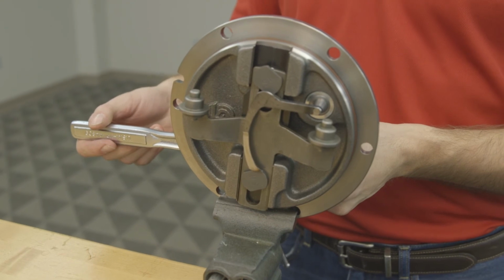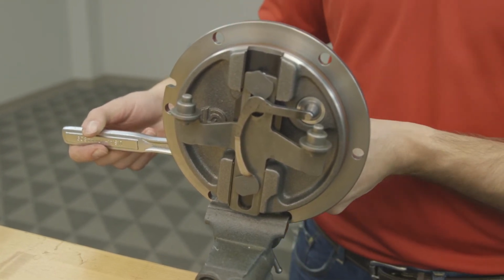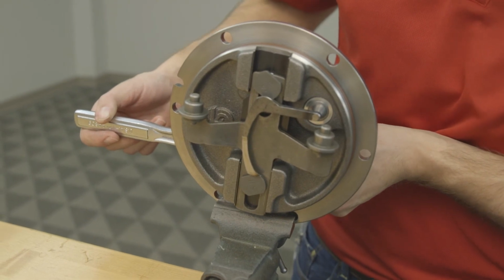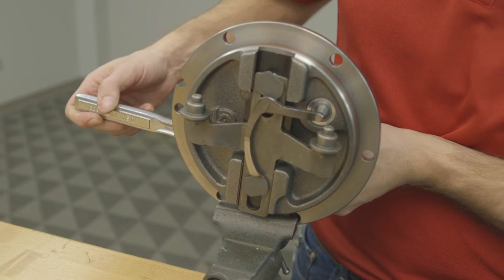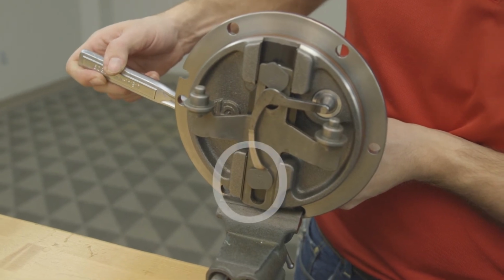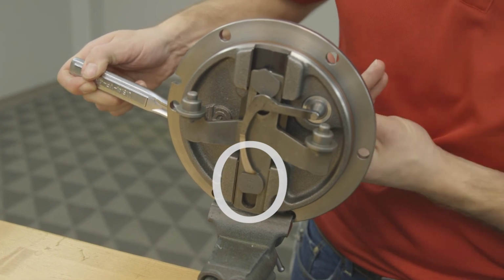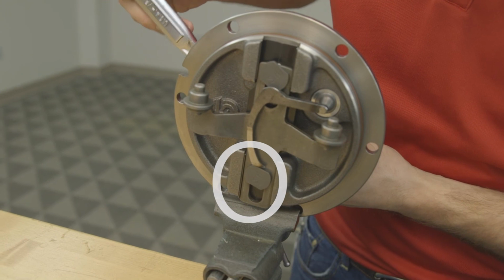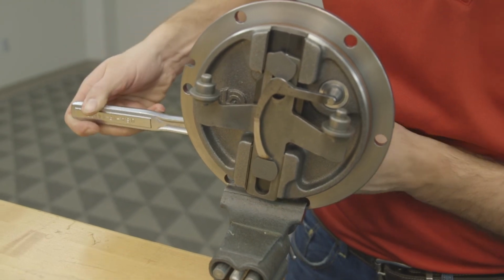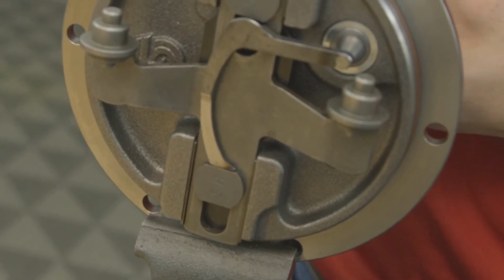At some point in the past, the machine owner or technician may have tried to stop the leak by turning the seal nut to try tightening the seal. If so, the guide post may likely be out of position. The technician can identify this if post threads are not visible when the wing nut is installed. If that's the case, try turning the seal nuts slowly until the wishbone deck and boot fall into position.